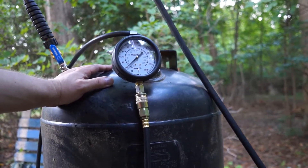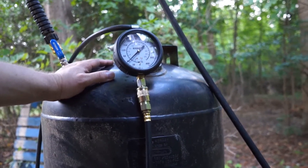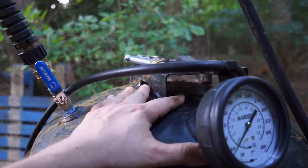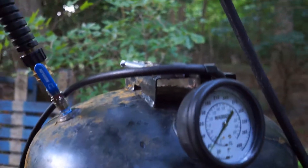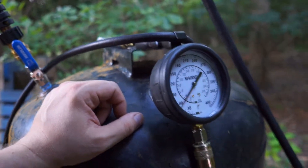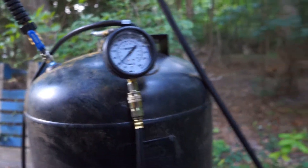So if the tank does burst, it'll only have the energy of that small amount of air when it bursts, so it should be fairly safe. There's probably about a sixteenth or an eighth of an inch of space above here, and I'm hoping that by running water under pressure into here until it came flying out the other side, I flushed most of that air out. I put a fitting in here and let that go also, so I should have flushed most of it out.